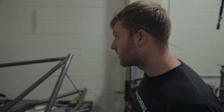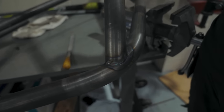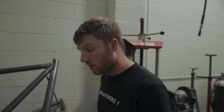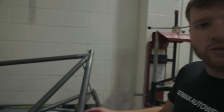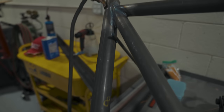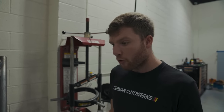Chris has done a fantastic job with the TIG welding on the rear section. TIG welding is a real skill of its own — we've been leaving Chris to it and he's been doing a great job. This cage is T45, which is a really strong material but also quite thin and lightweight — you can just pick it up no problem. If that were CDS, you'd need two people to lift it. So we're going for both function and form with this build.